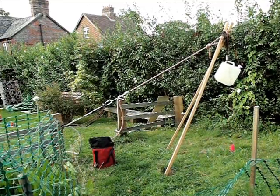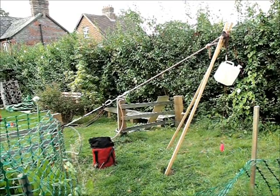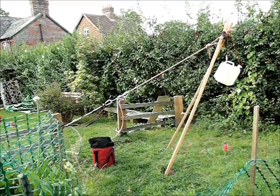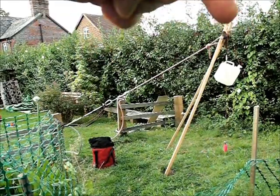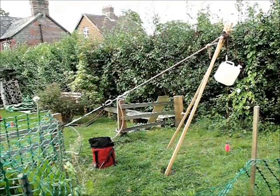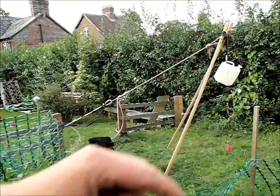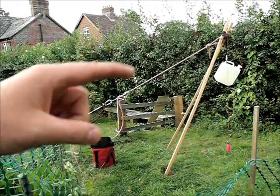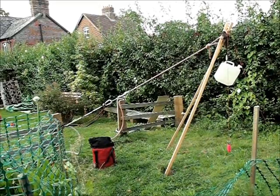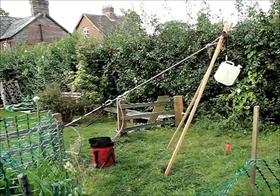There we go — we're pretty much on 10 kilos on the spring balance. Some of that is a little bit of weight from the rigging and rope gear, but obviously that'll be fractional on big loads. Really, a lot of the weight on the hook is essentially thrust down the legs. It's tempting to tilt the whole thing forward a long way to get reach, but the feet want to slide, and it's starting to put massive stress on that back line. If you go beyond 45 degrees — which would be pretty frightening — you'd be putting a lot of weight on that back line.